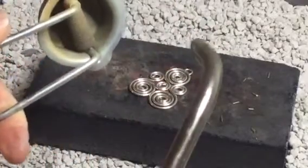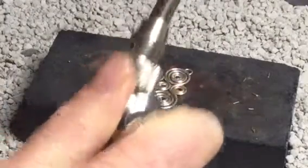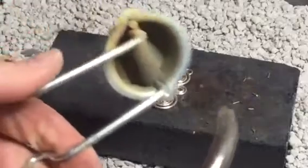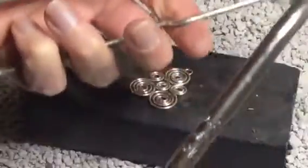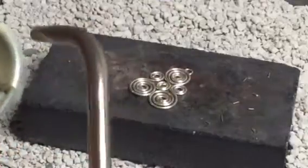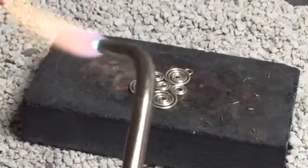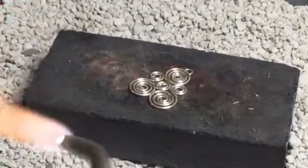I'm going to light the torch with my right hand — I'm right handed. I'm going to turn the knob a tiny bit to the left to turn the gas on, so you just hear that gas coming out. Aim it away from your work. Keep the flame away from the striker a little bit; you don't need to have it really close.